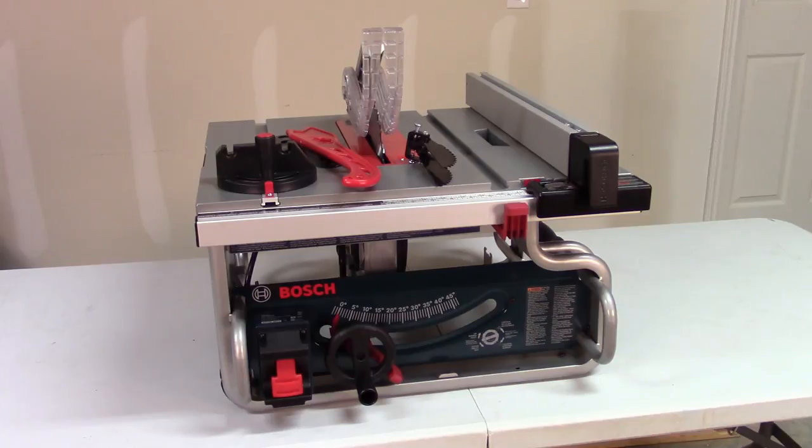Let's look at the specifications for the Bosch. This is a 10-inch, 15-amp saw. At zero-degree bevel, it'll cut through about 3.5 inches of lumber, and at 45 degrees, it'll cut through 2.5 inches. The RPMs are 5,000. This weighs in at a hefty 60 pounds, so if you've got to carry it some distance or up stairs, that's a consideration. The rip left is 8.5 inches and the rip right is 18 inches — I'll show you how to sneak about another half inch out of that in the fence section. It will take a dado stack with the optional table insert. It does not come with a stand, but it does have dust collection. Table size is 23 by 20 inches, and height is right at about 30 inches without attachments. Warranty is one year, and at the time of this video, this saw was $379 before tax and before any discounts.